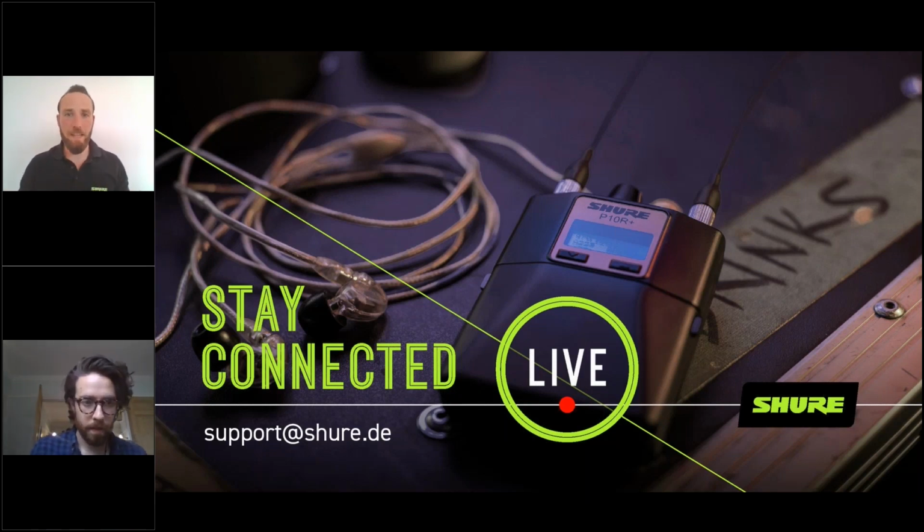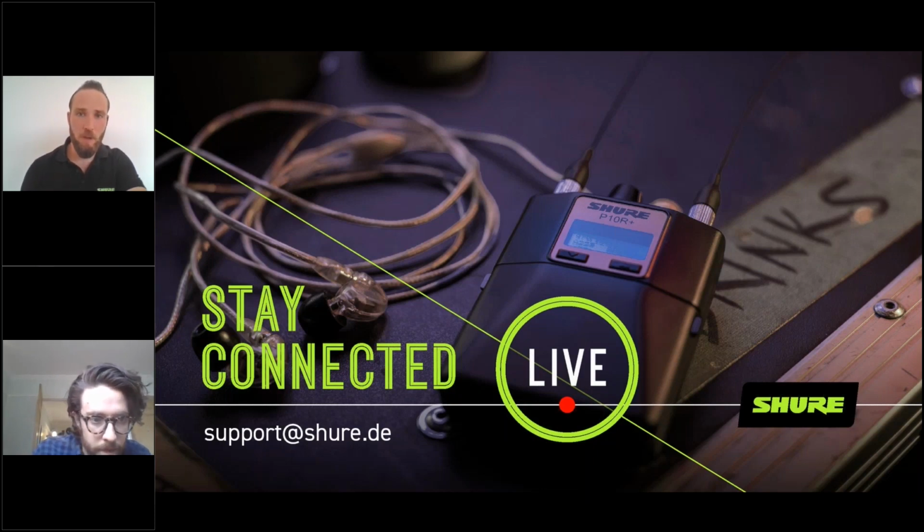If you look at the input level on the front panel of the transmitter, that gives you an idea how to set the input level control. You have an input knob here, and you can turn it, and it should not be in overload mode, but you should get a good signal. Usually if you use line level, it should be right at noon, and that should serve you really well.